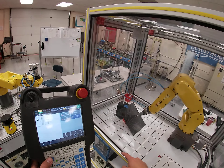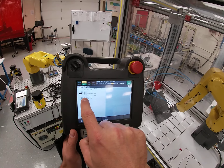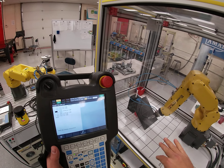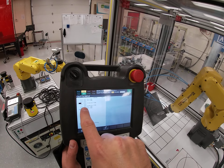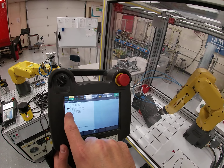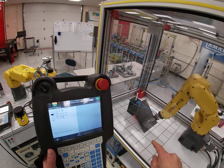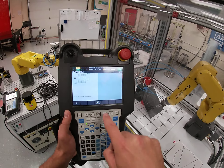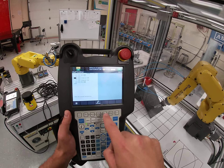We've recorded at this point and now have to move to the next point. It's not going to be an official point — it's where the blank space is on the circular motion. There are two parts to creating the arc. When you get to this point, jog in joint, get there, convert to world, and instead of doing point, hit shift and touch up. The screen only allows shift+touch up here — you're touching up the arc, not recording a new point. It will probably default to 5 mm/s; bump that to at least 200 or it'll be very slow.